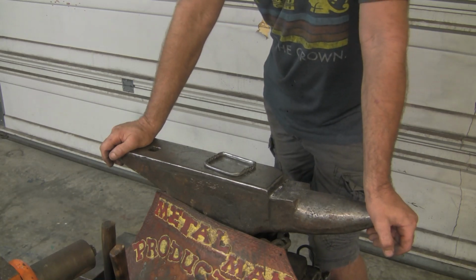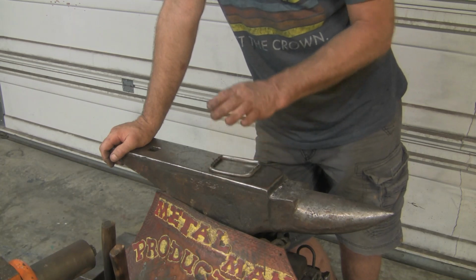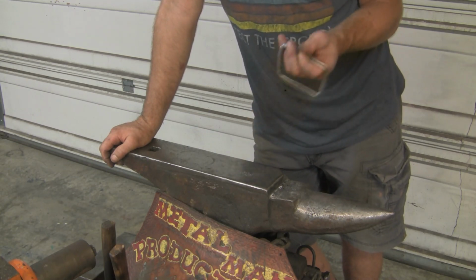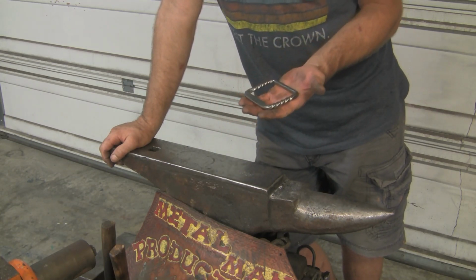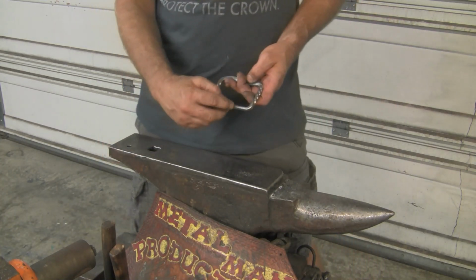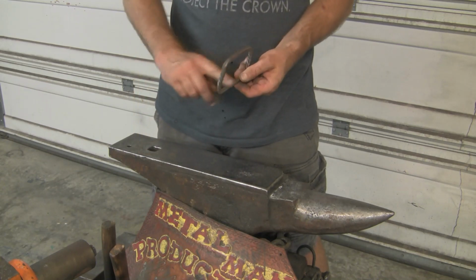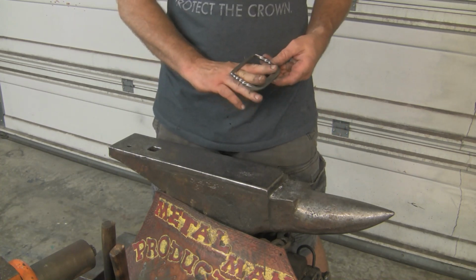Well, I was not good to go. The ferric chloride didn't cut through the galvanization all the way, and there's still a layer of copper on the piece of steel. So to save face, off camera I just went ahead and MIG welded this connection, and then I belt sanded it and filed it, and now I'm ready for the two prongs that the buckle is going to have.